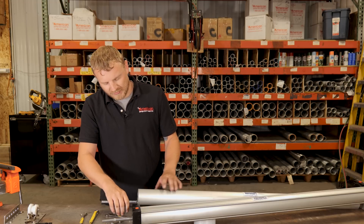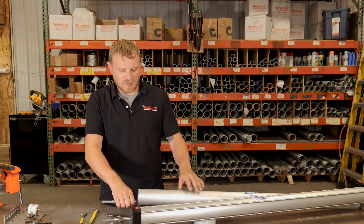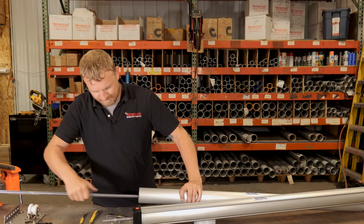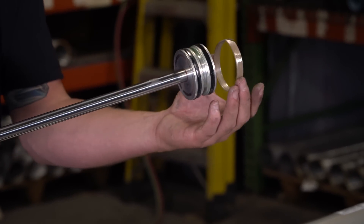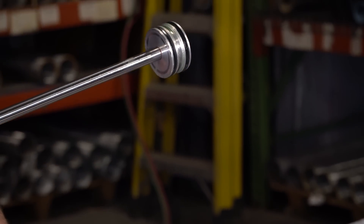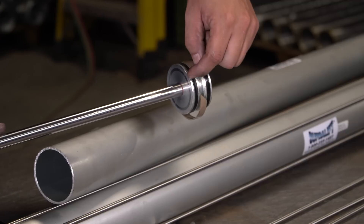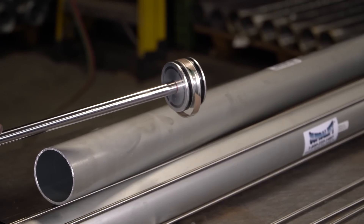At this point, you'll be able to pull the rod out and see the piston and the seals that are inside there — that's what we're going to need to replace. Now that we have this pulled out, you can see this one seal wants to come out; it just kind of sits in there, friction fit when you put it in the tube. You can see here you have two U-cups on the outside.